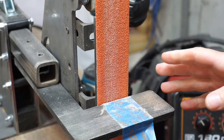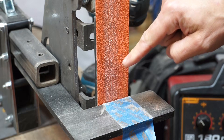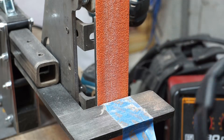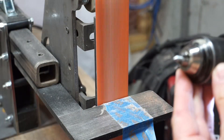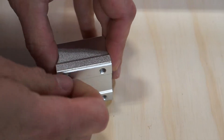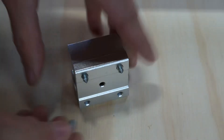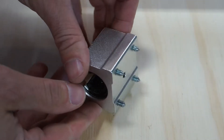I'm over at my belt grinder. What I'm going to do is take the drill, angle it down, and just touch the end of the screw while activating the drill into the belt, which will help us create the point. And that's it. I'll do this three more times. With the points all done, I'm just going to screw them in place.